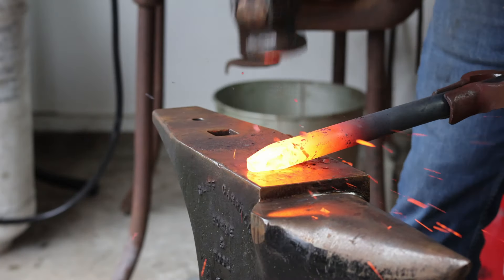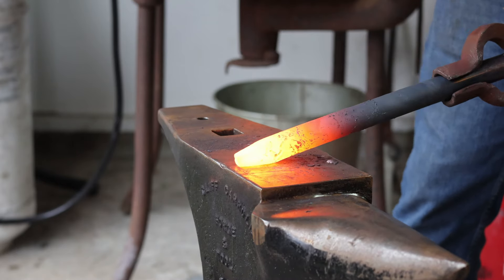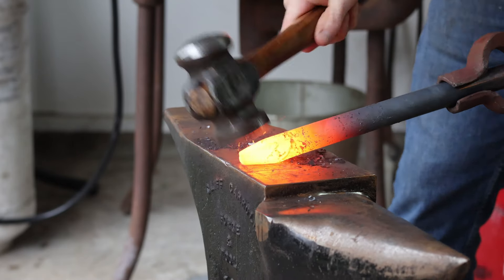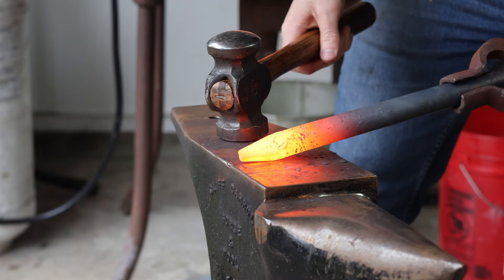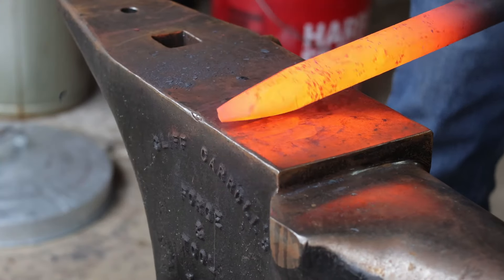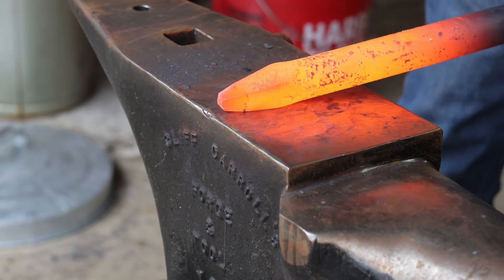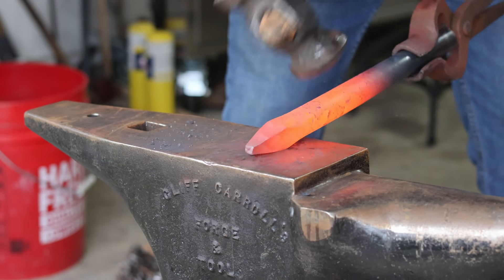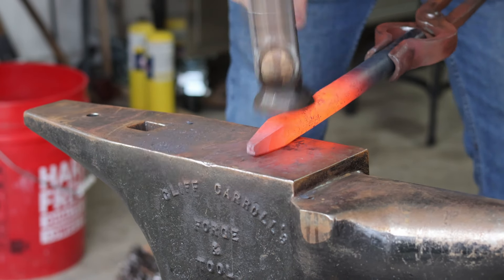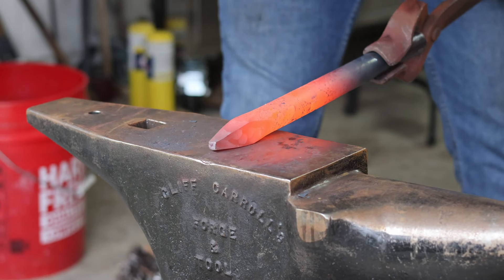So what is a drift? A drift is a generally non-heat-treated, non-hardened piece of steel that is used to widen a hole that is originally punched using a hardened punch. The reason you use a drift instead of just hammering your punch all the way through is because usually the punch is forged to punch out as little material as possible so that you're keeping as much of the material around the eye of whatever tool you're making as you can, and it is generally skinny to facilitate that.